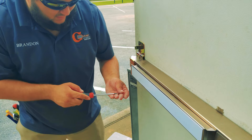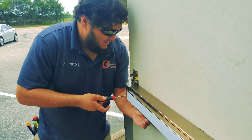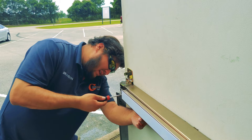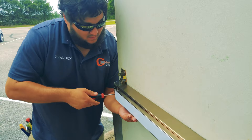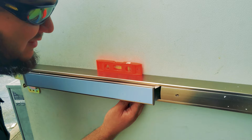Be careful not to tighten the screws. We haven't actually leveled the panic bar just yet, so that's the next step — making sure everything is flush against the door so that there's no binding issues once the installation is done. What I recommend for any hardware installation is the magnetic level. It makes it easier, won't pull off the door.